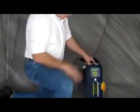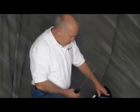The unit has gone into the next step, and right now it performed a purge. That's the first thing it's doing, so it's drawing the air sample in to zero out the unit. You'll know it's on because it's going to start beeping. It did come up with a press check, which is not a check button — it just means it's pressure checking. Through that warmup cycle it temperature stabilized the unit.